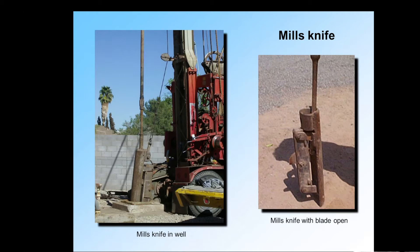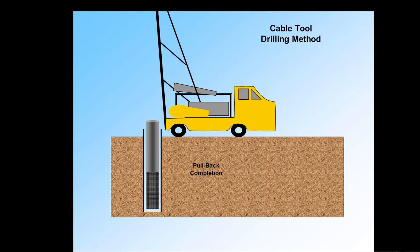But what if we want a manufactured screen? We can install a screen smaller in diameter than our driven casing and then do a pullback completion. This is a little bit tricky, but it's been done in our industry hundreds of times. We install the filter pack as we drive, then pull the casing back out. The reason it's tricky is we can't let sand get locked between the exterior casing and the interior wire wrap screen, because then the screen would also come out. Drillers know how to do that — they are very careful and diligent about being sure they don't get sand locked.